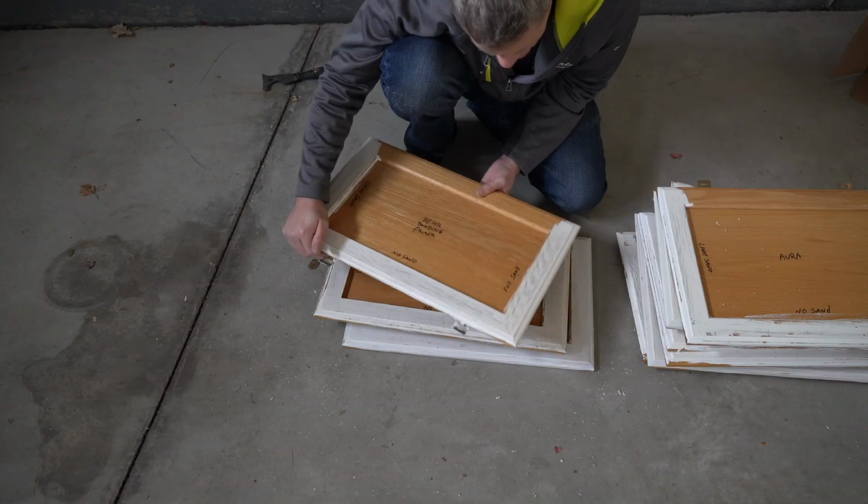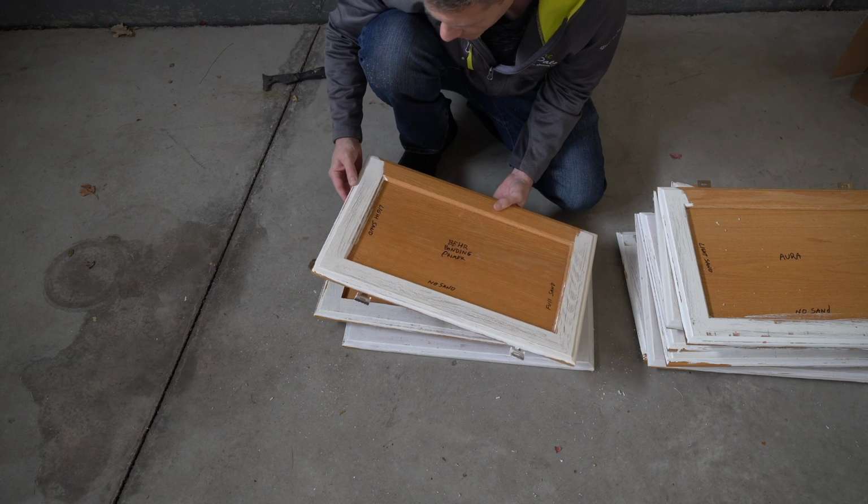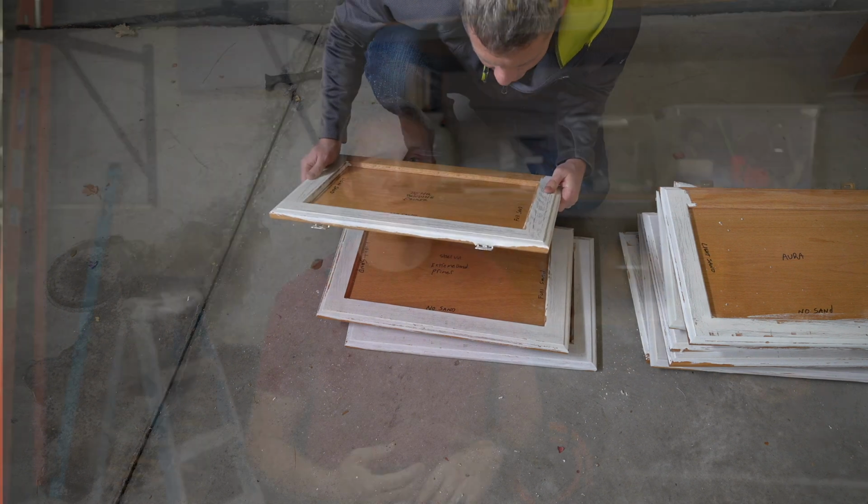Different paint manufacturers make what are called bonding primers that are supposed to bond to things better. I made a video, I'll link it here, where I test some of the water-based newer bonding primers. A lot of the older traditional stuff would use non-water-based products like oil or alcohol or some kind of solvent because they tend to have better properties when it comes to bonding.